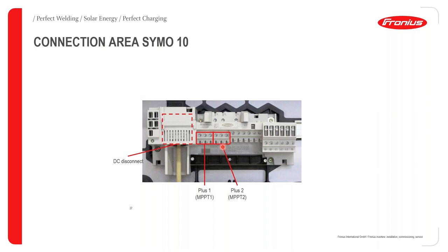As you know, in a parallel circuit, the voltage over those six branches, if you take the overall voltage, will be the same. So if you have six strings of 1000 volts DC each, the overall voltage of that parallel circuit will be 1000 volts DC, which again follows local regulations as well.